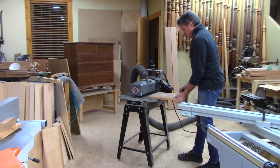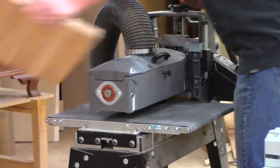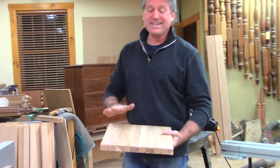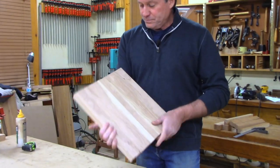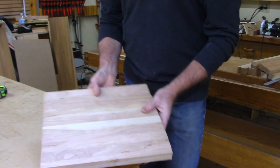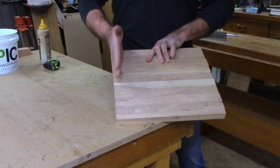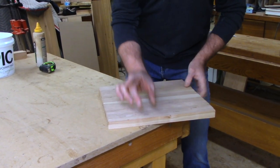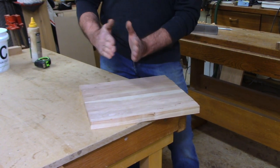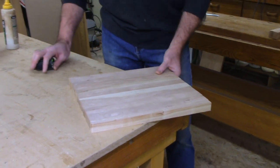If I were to sand it, I'd go over here and run it through the drum sander. That's pretty nice to have a drum sander for things like that. Now that I've got both sides smoothed, I'm now ready to cut this into strips. Here's my end grain here — I'm going to first square up one end, and then we're going to take cuts about almost an inch and a half wide. Those will be flipped up on end to reveal the end grain and then re-glued up. Follow that? Let's do it — it'll be very clear.